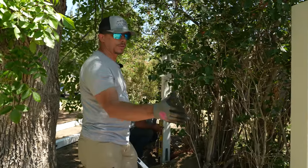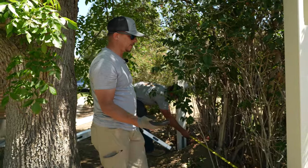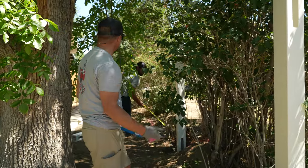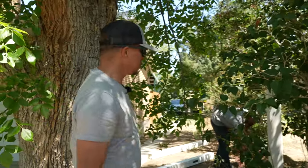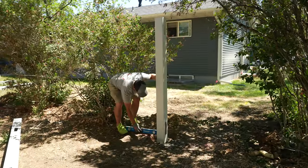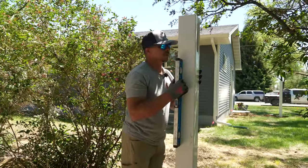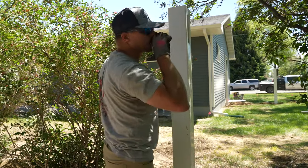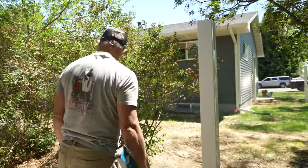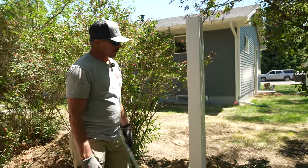One of the other things you might notice is that we're not sitting in any of the bottom rail. All we're trying to do is make sure it doesn't exceed our max spacing, which is 96 inches center to center. So as long as we don't have any spaces more than 96 inches center to center, we should be good. The goal is to have that bottom rail about two inches up off the ground so we've got a little up and down to play with. When we grade it out we're basically going to use the same method, make sure it follows the slope and contour of the ground while still looking good — so we may follow some dips and ignore others to get a consistent look.